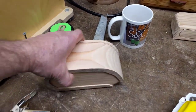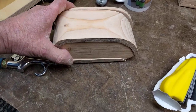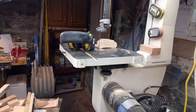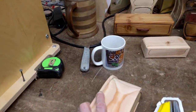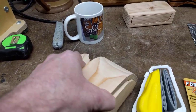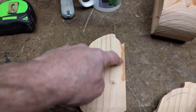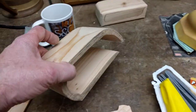This box is in its rough state — we just cut this one out. There's the middle of the four by four that was left over. We cut it out on the bandsaw, so what you have is a back piece, and then you have the drawer like this. The tip I have for you is: you definitely want to sand the insides of the box before you glue it up.